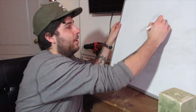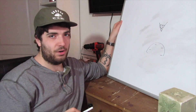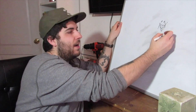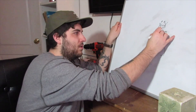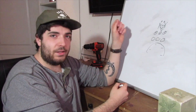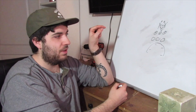Okay, so first of all, we need to have a sharp edge and a rounded edge. This is the most important part. The sharp edge is generally positive while the rounded edge is usually negative. At the sharp edge, the electric field is actually stronger because the charges are packed closer together. The electric field is so dense at this point that it can actually rip electrons from the air. As the electrons are being ripped away from these air molecules, they turn into positively charged ions. We also have our neutral air molecules — we'll just leave them blank.